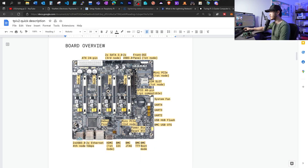We also have two SATA 3 ports, some USB 3 pins for your case, a bunch of GPIO pins, and two Ethernet ports controlled by an integrated switch chip — meaning each one of these nodes will be able to get its own IP from your router, essentially saving a bunch of cables. You also have two USB 3 ports, an HDMI port, and two mini PCIe slots. For the mini PCIe slot next to node 1, there's also a SIM card slot. This board supports 4G, 5G, even LoRa WAN for some of those Helium fans. You've got Zigbee too and Bluetooth.